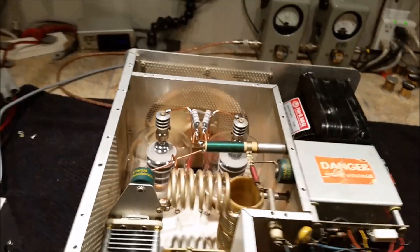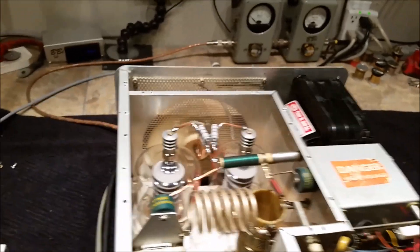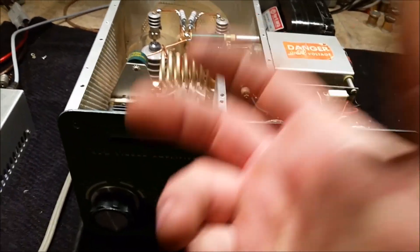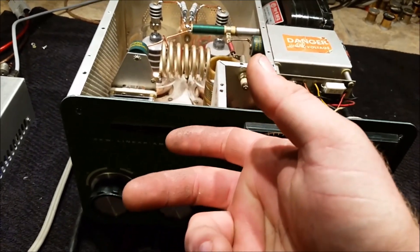The other thing I did is I also took your fan completely apart — it was sitting there making noise and was all full of crap. So I took the whole motor out and cleaned it. Sonic treated it, and then went ahead and re-oiled and redid all the bushings in it. Now it's whisper quiet again, bud.